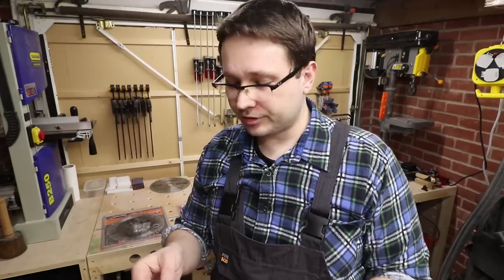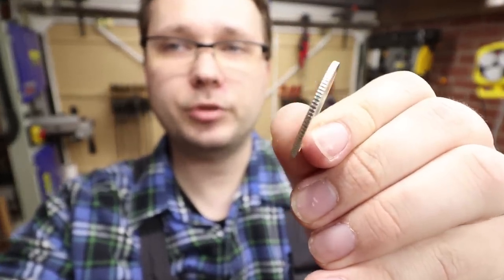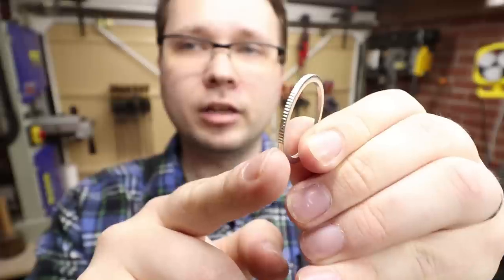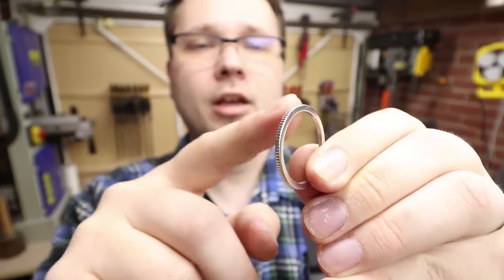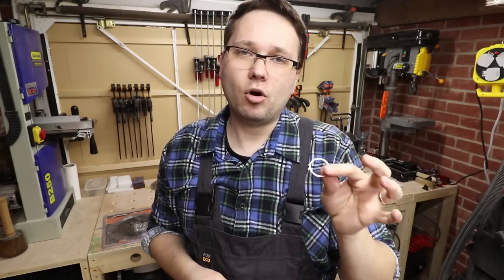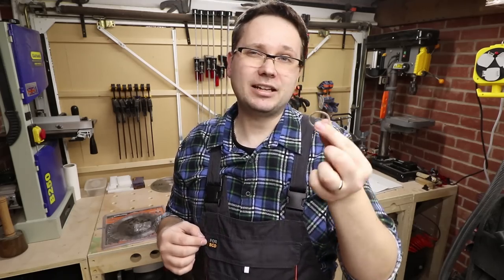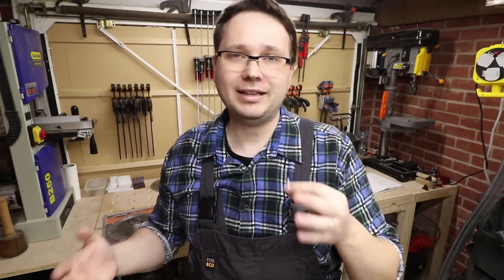The second option is a reducing ring from Bosch. This one has notches in it, so it bites into the metal of the blade itself, preventing it from spinning on the ring. It costs a little bit more — I'll try to link it in the description — but it's definitely worth buying something decent to prevent potential issues. This is what I'm going to be using.